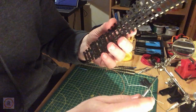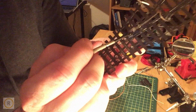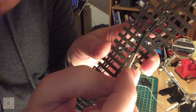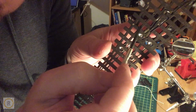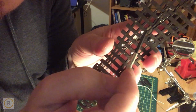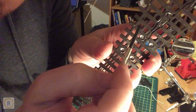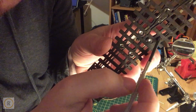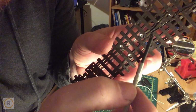And on a three-way switch they make it a little bit more difficult, because at this point here, there's two little gold contacts, if you can see them. That's the inner rail, and we need to connect it to this rail and this rail. And these two are covered by plastic, so we have to chip away and cut off this plastic. Then we have to solder a wire going from here, which makes contact in the middle, and then makes contact with the outer. And then the same over here. So it's a little bit more tricky, but it's definitely doable. So that's what we're going to do.